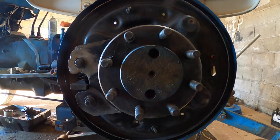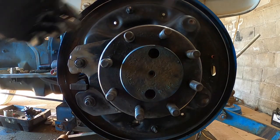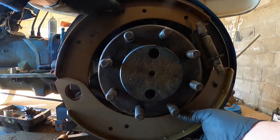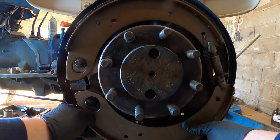Okay, I've gotten over the whole deal we spoke of earlier about the way this was put together. I'm right and they were for sure wrong. I've got the brake shoes together here with the top adjuster and the spring in it — it's like holding on to four bananas with Vaseline all over your hands, if you will. But it sure makes getting the spring in there a lot easier. I'm going to try to get this around there and hopefully get the shoes over this, then get the pins in the back to hold them, and get the rest of the springs in.